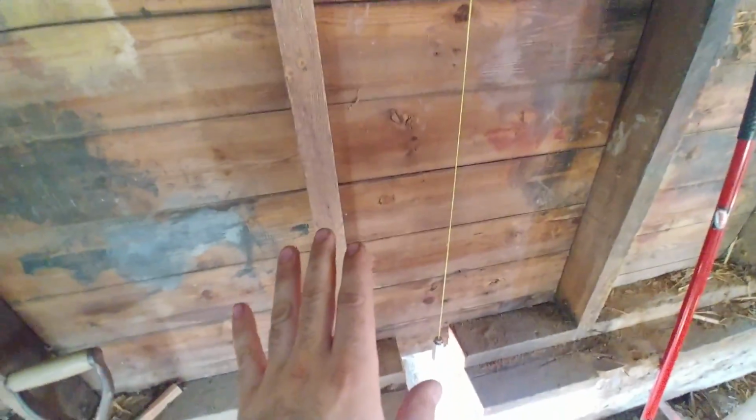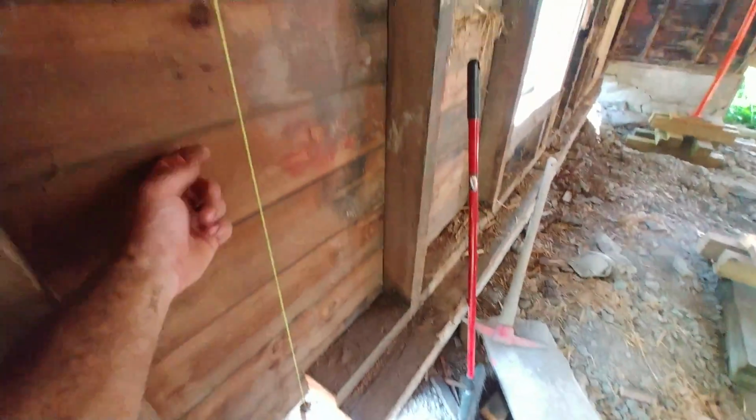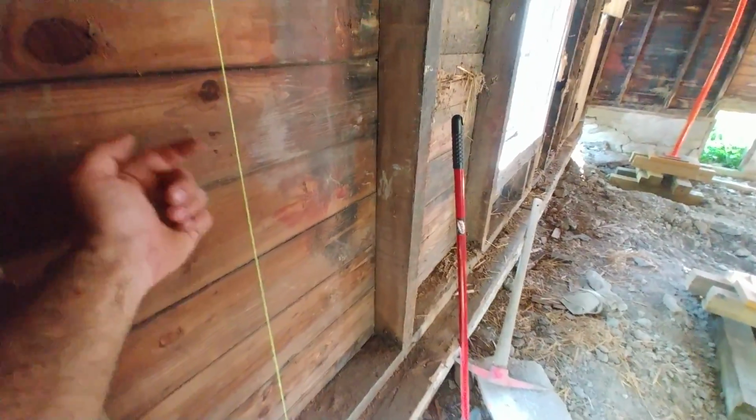And then I'll probably set up something here and pick this wall that's sitting down from its own weight up again with the bottle jack, maybe right here, until I'm off the foundation, and then go outside and nail right up this post through the sheathing outside, each one of these boards to that new post.